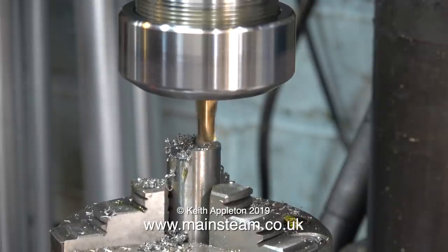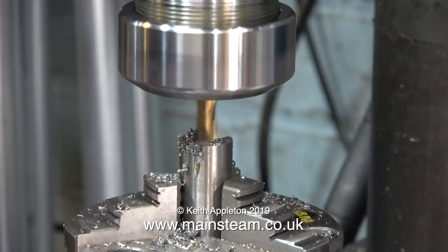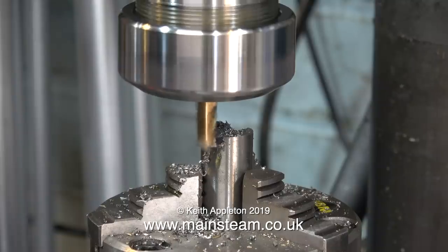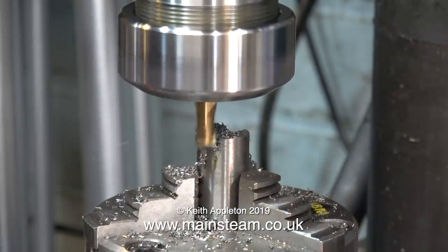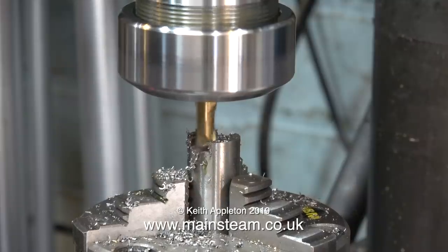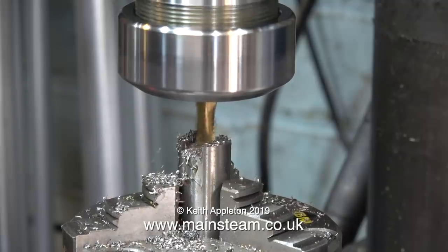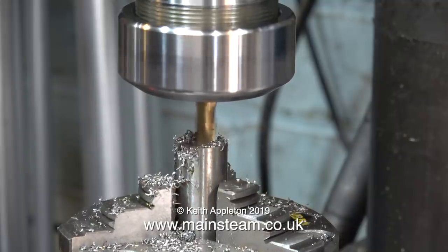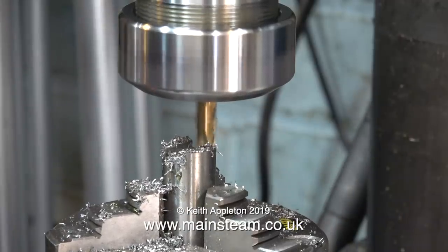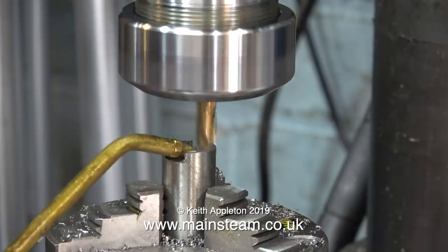When I was at RDG Tools, I bought two of these ER40 collet chucks — one for the milling machine with an R8 taper, and one for my small Boxford lathe which has a number three Morse taper for the spindle. The R8 taper has a slot up the side of it which engages with a peg that bolts into the spindle, but that's not really strong enough to hold the R8 taper when I'm tightening the collet ring with such a big spanner. With the amount of leverage, I'm worried I would shear off the pin that holds the R8 in place.